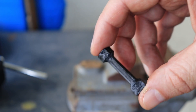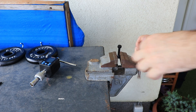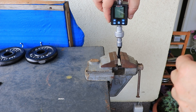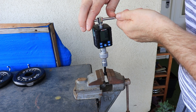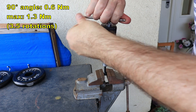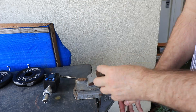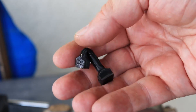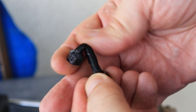The torque or twist test — the diameter of this test object is 6 mm. One side goes into the vise and the other to the torque meter. I want to record the deformation under 90-degree angle: 0.6 Nm, and the maximum load: 1.3 Nm. Very interesting material — look at these deformations after 3.5 rotations, almost like some flexible TPU materials.